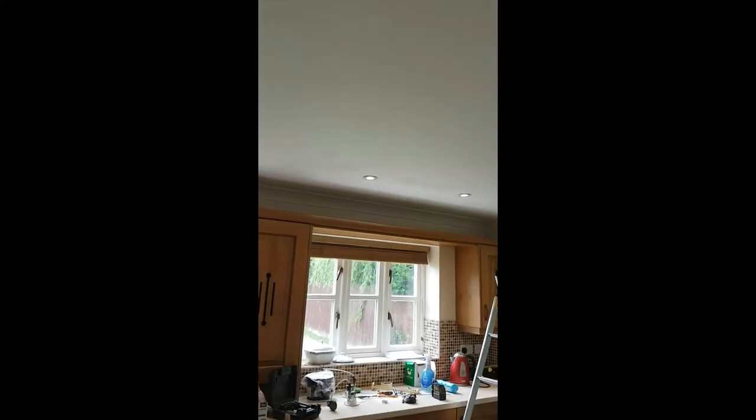You can see they give out a lovely bit of light over the worktop. These are eight watts, so slightly brighter than what you'd be able to buy in just a normal LED lamp. Now, as you can see, this is what we call an integrated fitting — there's no lamp to change. The LEDs are actually built into the light itself. These lights come with a five-year guarantee, so if it goes wrong within that period, you just take it out, take it to the wholesalers, they'll give you a new one, and you put it back up. These lights are also IP65 rated, which basically means you can fit them in your bathroom or anywhere with a lot of moisture in the air. I'm very impressed.